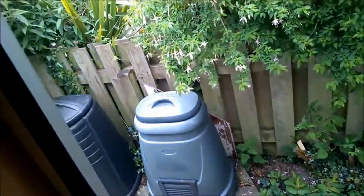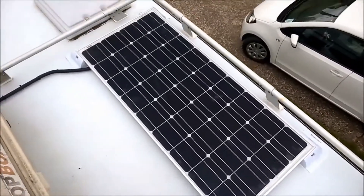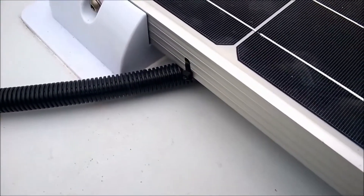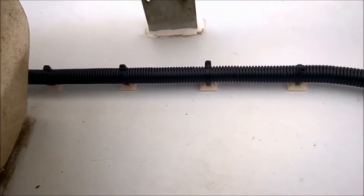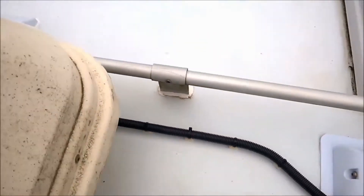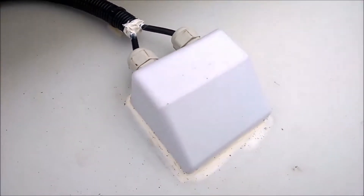Back up on the roof. There's my panel and there is my convoluted tube. I've drilled a little hole in the side there with a zip tie to hold it up off the roof, and then I've used the little stick-on pads that you can get in Screwfix — 19 millimeter ones. I've cleaned the surface of the roof really thoroughly with isopropanol, so I'm hoping they'll stay stuck. There we go, and then it comes around and into the unit there.